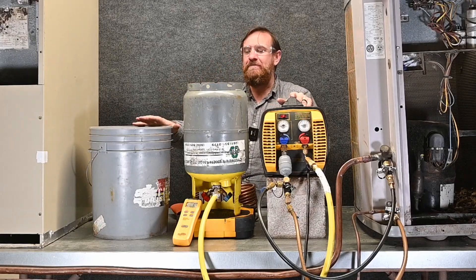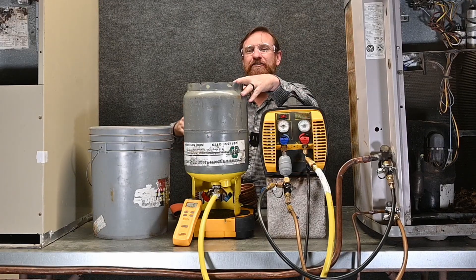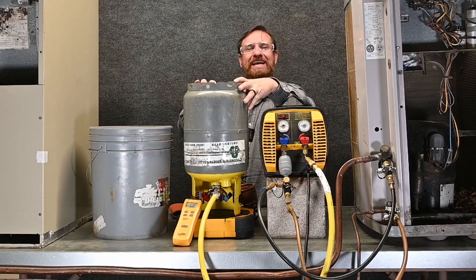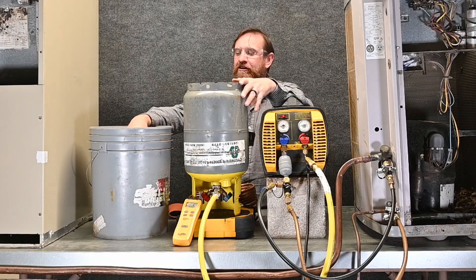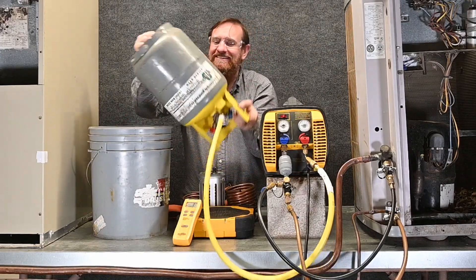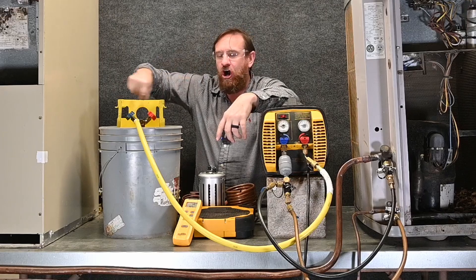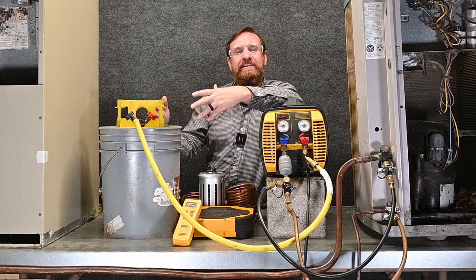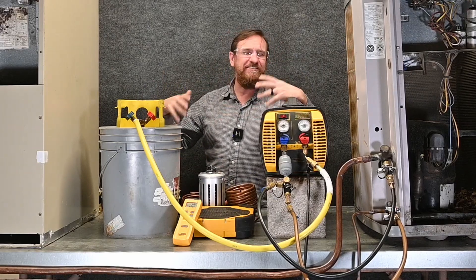There are a few important issues with this method. Once we use water, it interferes with our scale, so we're removing the scale from the scenario and won't know how much refrigerant we're putting in the tank or if we're close to overfilling it — that's a warning. Also, the volume of the tank takes up almost the entire volume of the bucket, so there's very little water around it. Your options become continuously adding ice or running water, which creates a wet environment with lots of complications.